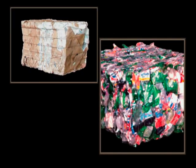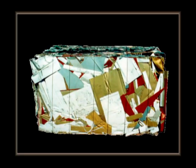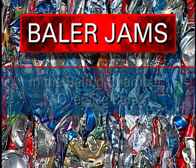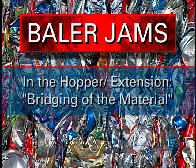The baler is built to bale a wide variety of materials. However, the operator may experience jams. A jam may occur at the knife, sometimes referred to as will not cut through the material, in the baling chamber, such as an oversized bale, or in the hopper and/or hopper extension, often called bridging of the material.